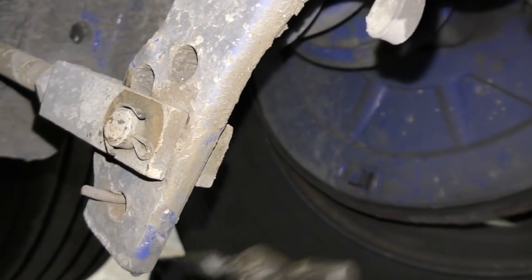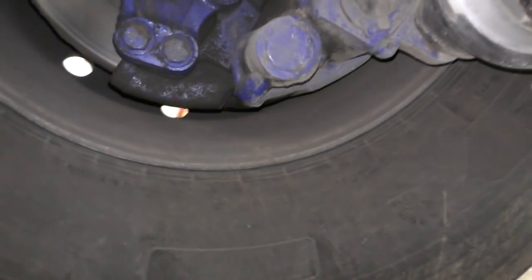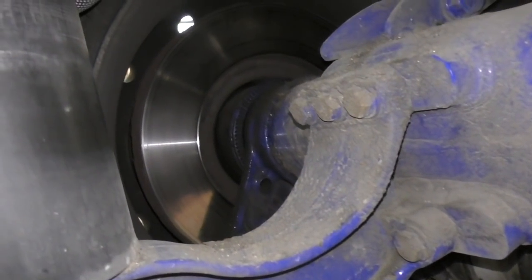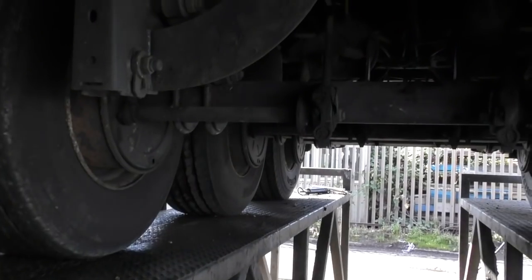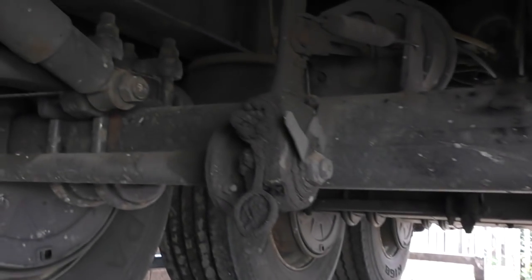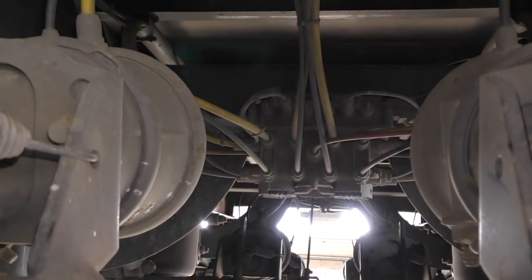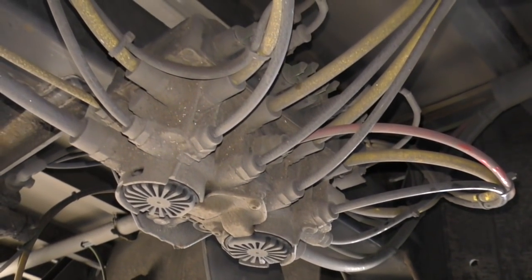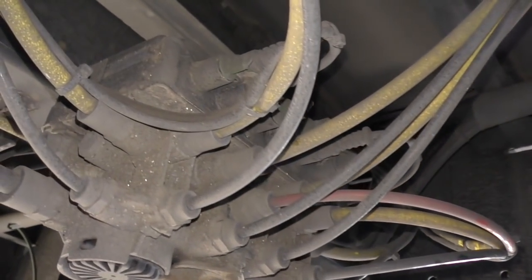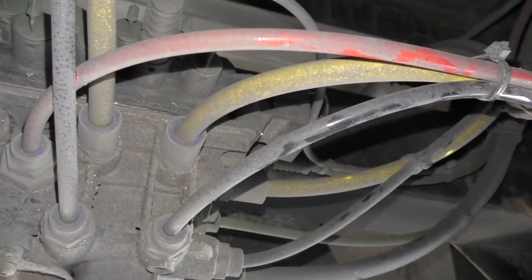Discs, on the other hand, are more compact - you have a caliper and brake chamber all in one lump just there. So you can see how that fits together, just like you would have a caliper on a normal vehicle. Slack adjusters and cam bushes. You also have brake chambers - they're push rods, air operated. Push the slack adjuster, puts the brake on. Simple. It's an air system, controlled now by an EBS system - electronic braking system. This has got a brain and it's a modulator, so it actually does quite a lot. Very complex bit of kit - need a computer to access it and diagnose if it has problems. There are only three makes of braking systems.